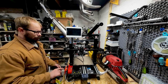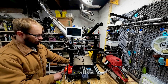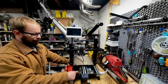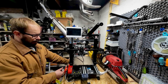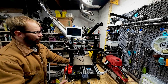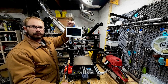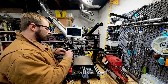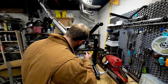We're running Canbus — there's a little mini Canbus board that mounts onto the BigTreeTech board, so it's all in one. The Pi also has power terminals in the back so you can run it off 24 volts, so my power supply powers the Pi and that power also comes into the Canbus cable to power the toolhead. What's really cool is if I want to take the toolhead off, I just have to unplug this wire and then there are four hex cap screws on the side.